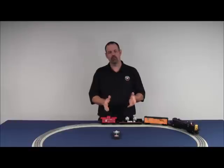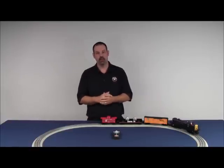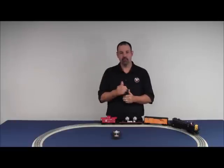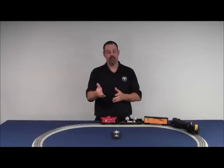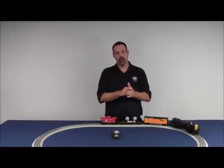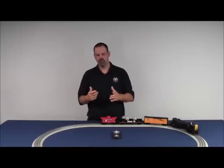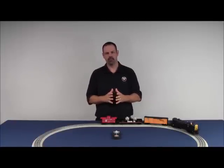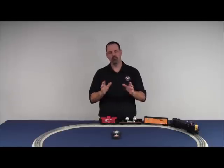So the first thing you want to do is check the barrel jack adapter track and make sure that the red LED is illuminated. If it's illuminated, that's a good thing. If it isn't illuminated and the wall transformer is plugged into the outlet in the wall, the first thing I would suggest doing is trying another wall outlet, just to verify it's not the transformer. Plug it into a different outlet, the red LED comes on, great.